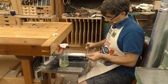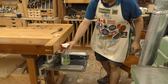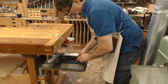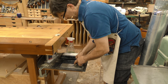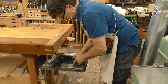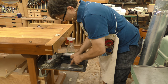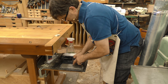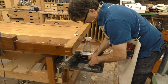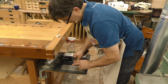For the actual sharpening process, I'll put the chisel back together. All of my future sharpenings are really simple. I start on the 1000 grit, making sure my 16,000 is flat. Find the primary bevel — I like to keep the two hands tied together. Find the primary bevel, elevate slightly. On narrow chisels, I just do short forward and back strokes. If you try a circular process with a narrow chisel, you'll easily end up skewing the end of the blade, and you want to keep it relatively square. Anywhere from 5 to 8 seconds on this until you can detect a slight burr on the backside of the blade.